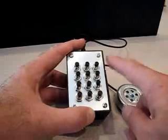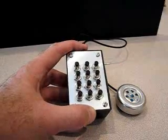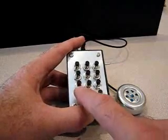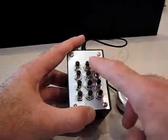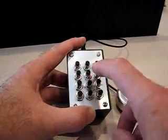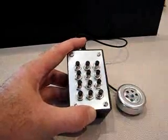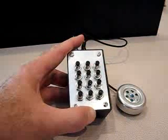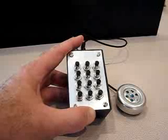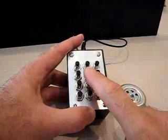It's also possible to store a 2600 Hz tone as part of a sequence. I'll press 2600 on power-up, press 2600, then key in a dialing sequence and store it to memory five. When played back, there's a built-in one-and-a-half second delay after 2600 plays, to allow time for the wink-back from the trunk, and then the digits play. That delay is fixed and cannot be changed.